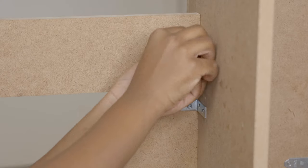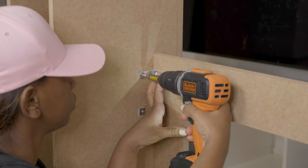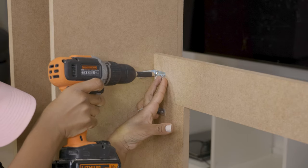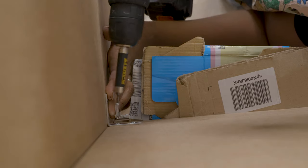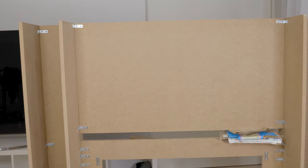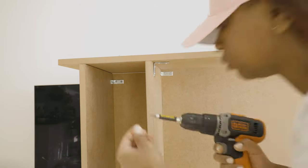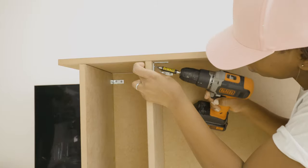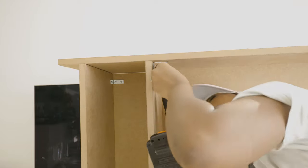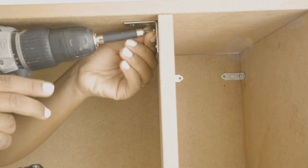Then as usual, I took the connectors, added some wood screws, and screwed them in to make sure it was stable. I didn't have a spacer piece that would fit in between, so I ended up using some boxes — just put them together and put them in that space. The following day, I attached the top plate using angle connectors and screwed them in to make sure it was stable and firm.